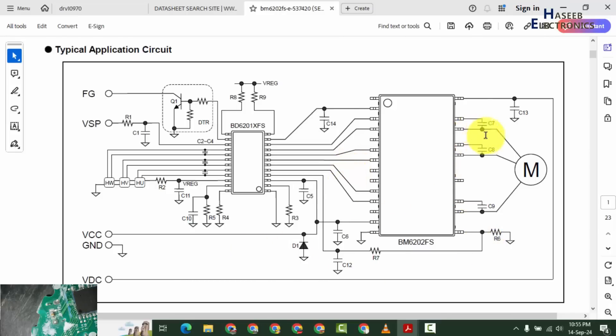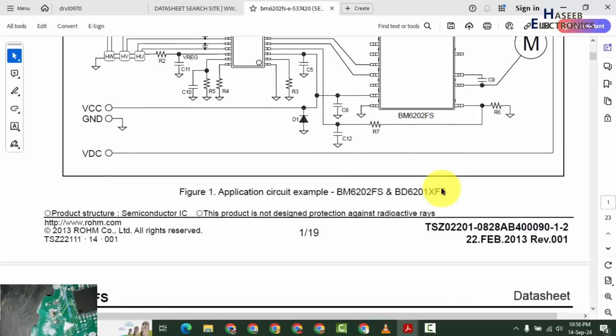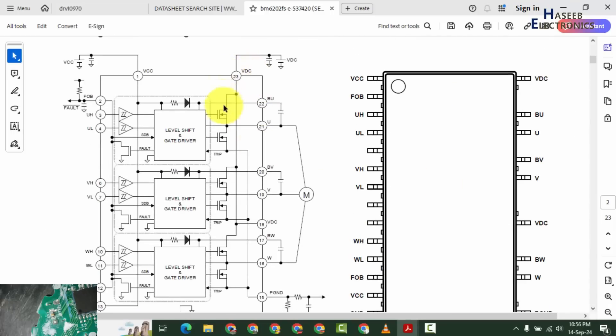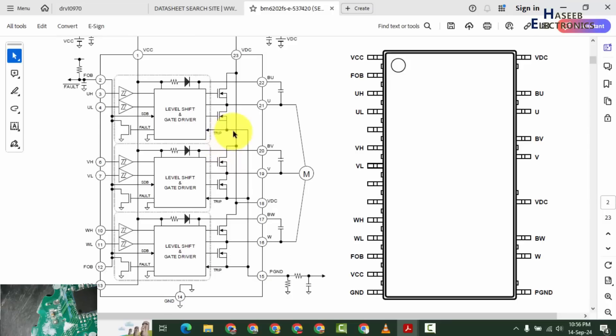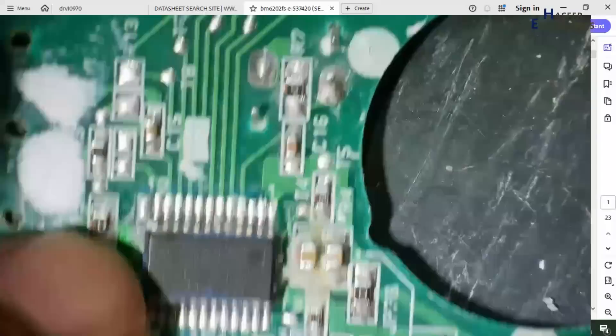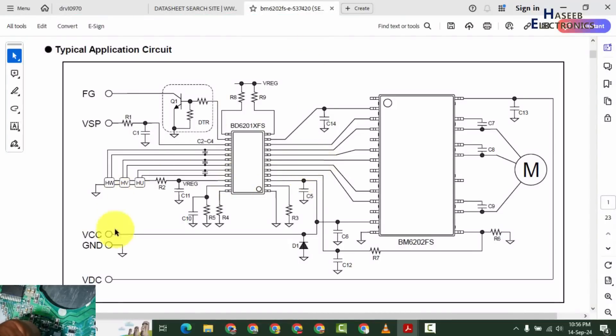It will provide the switched voltage — VDC 310 volt — directly to the high side IGBTs or power MOSFETs in the output stage. The VDC positive is on one side and in the bottom side the MOSFET is connected to the ground side using current sensor resistors. Six signals will be provided from the controller IC.